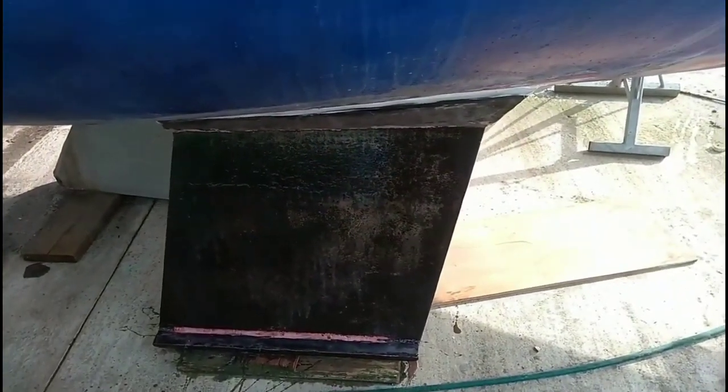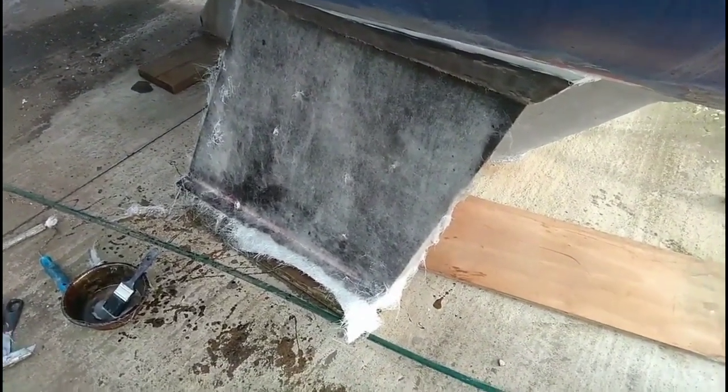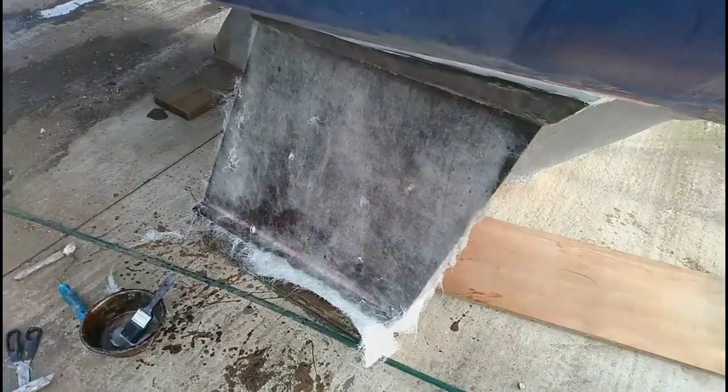That's the very first layer of epoxy going onto the metal with nothing else. The next stage is to apply the very first layer of the chopped strand mat — this is the powder-bound mat especially for use with epoxy, and it's been a nightmare. I wish I hadn't started there actually, that's how difficult it was. It was a lot harder to work with than regular fiberglass with polyester resin. We've got to get some woven on that now and then another layer on top. It just doesn't wet out like regular fiberglass does with polyester resin.